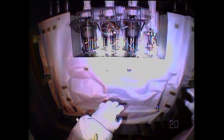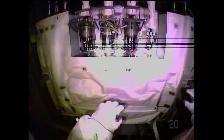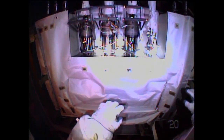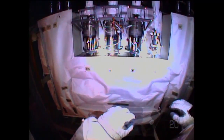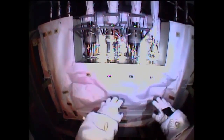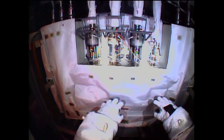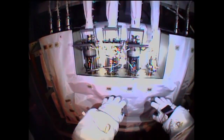Let's talk about this for a second because you're very familiar with this work site. These quick disconnects can be a little bit tricky, can't they? They certainly can — they are our largest quick disconnects on orbit. When we did this task in 2010, those lines were pressurized up to about 360 PSI, which made the operation a lot more difficult. We have since reduced the pressure for these tasks — the lesson learned — to about 180. The check is tucked in. Looks good.